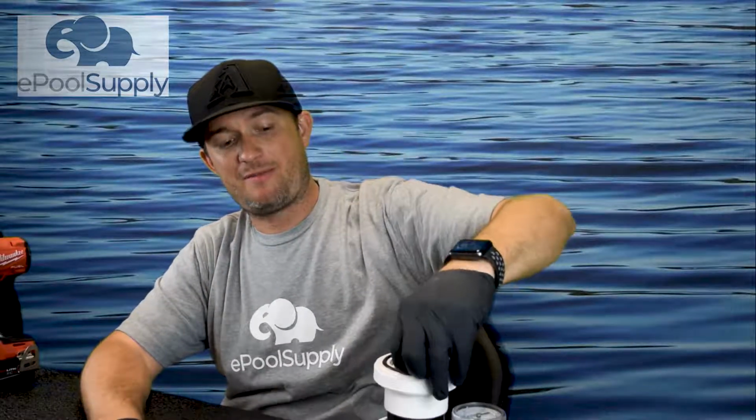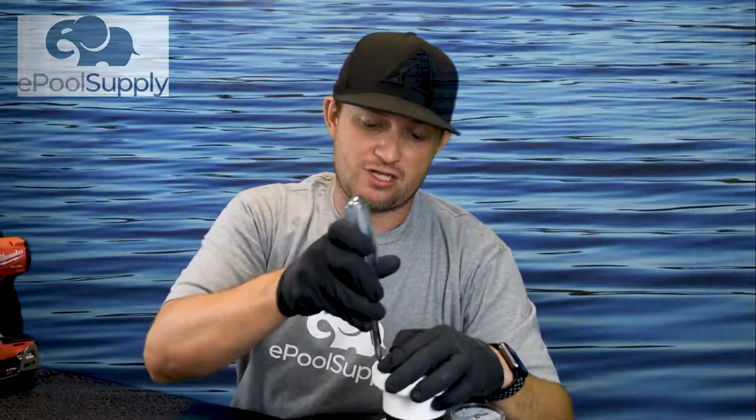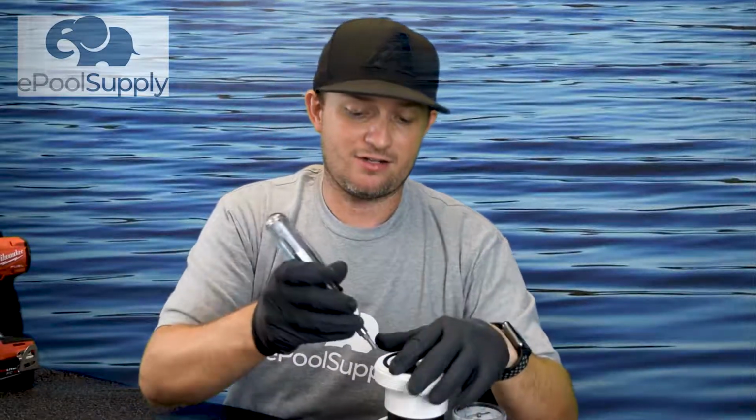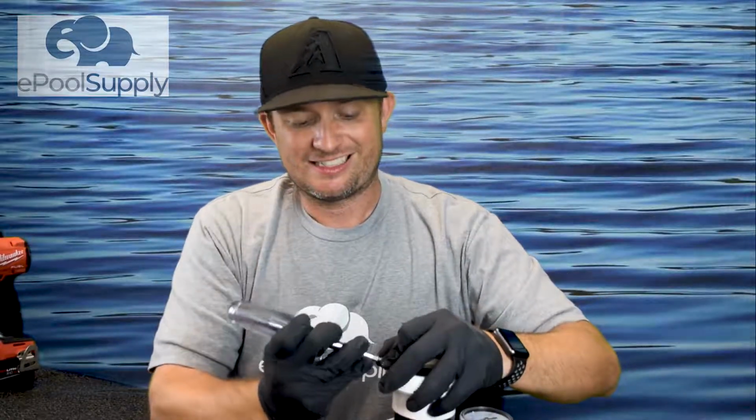Let's dive in. The kit does not come with a screen ever, so keep your screen. There's a big O-ring on the outside of the valve that's really hard to get off. It does not come with that either, so make sure you keep your big O-ring. It's also your union O-ring. Okay, this is a pain in the butt. This is a brand new valve, so it's pretty tight from the factory. There we go. All right.